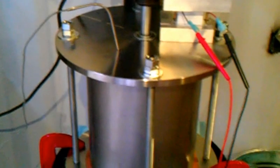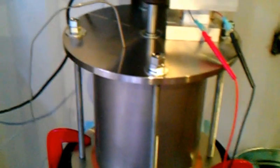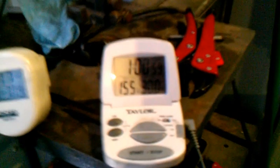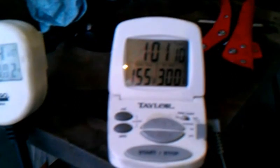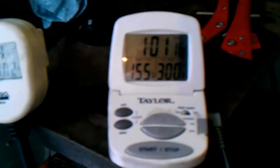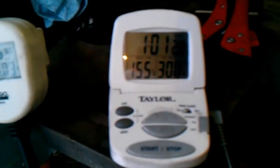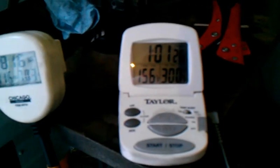Optimally, this heater needs to draw 450 to 500 watts to rise temperature at about 1 degree Fahrenheit every 20 seconds. If it doesn't have that load or that specific K factor, the increase is a lot slower. We've had a continuously rising temperature from the 130-degree range at around 40 minutes, up to 155 degrees at one hour.